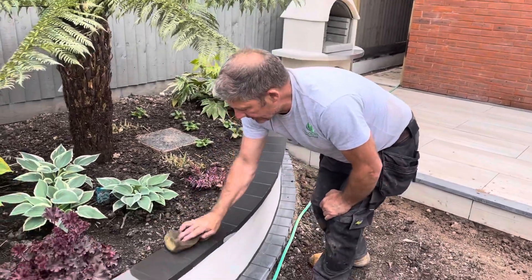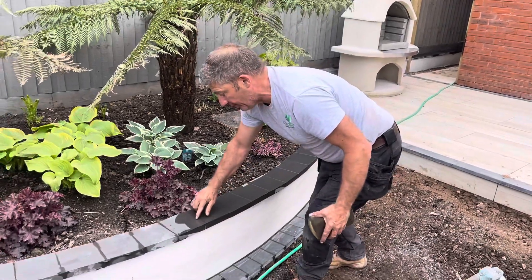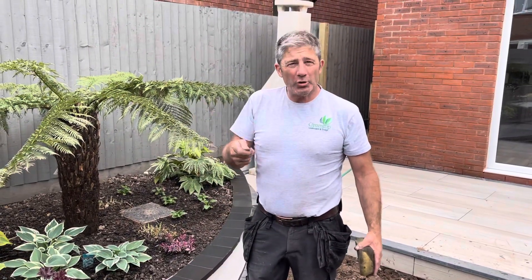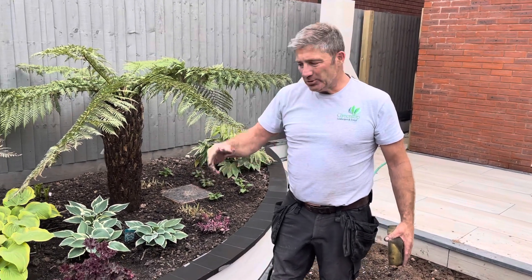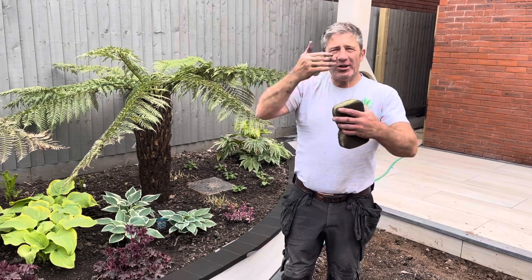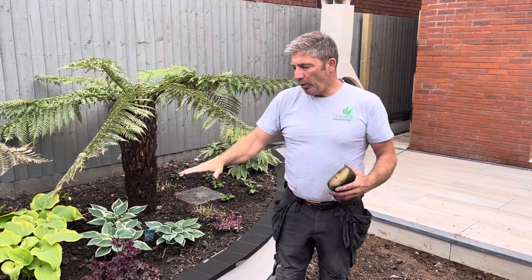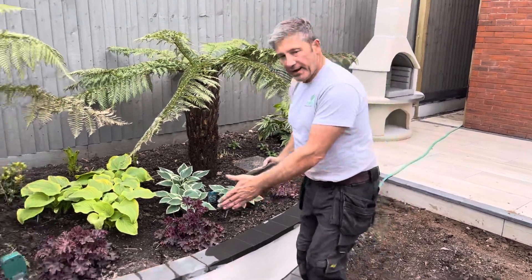The important thing — and Lee will confirm this — is that when you're actually sponging off, you need to let the grout go off a little bit. Don't worry too much. Only mix up in the pot what you can manage. Just let it go off, because when the grout falls between the joints it's designed to heat up and start to go off. Then what's left on the surface is left in the open air, and that will clean off.